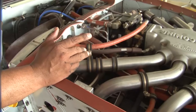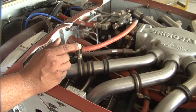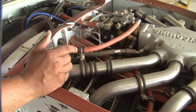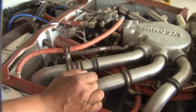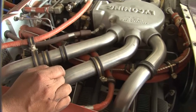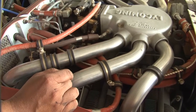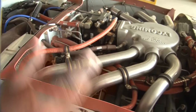It is basically a paper induction air filter and we will clean it with the dry air. And we will tap gently on the ground to remove any dust. So this filter should be cleaned at every 50 hours of operation. The manufacturer calls for its removal after every 1 year. So I will show you one induction air filter.